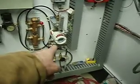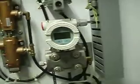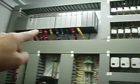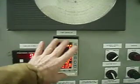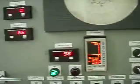That level indicating transducer, which right now says 66 inches, sends a signal to that controller, and that controller speeds up or slows down motors so that they stay running as long as possible. If that controller fails, we have a second controller here. That's the simplified version of the level, and we're at level, but this one is not being used, just ready. We have to switch over to it if we want to.